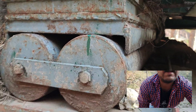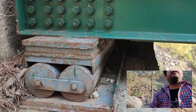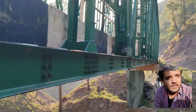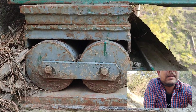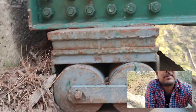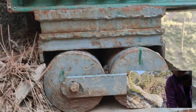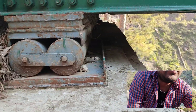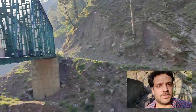This roller is basically provided to ensure the expansion or contraction of the entire steel truss, which is 48 meters long. It may be helpful in releasing the tensile or compressive stresses generated due to contraction and expansion of the entire truss. This is one detail which is very less visible or very rarely encountered by design engineers. At the other end, I have seen that it is supported by two elastomeric bearings on both sides.